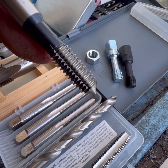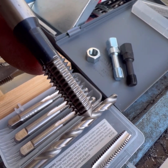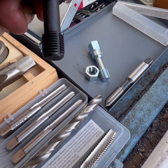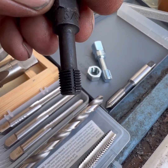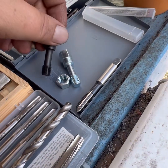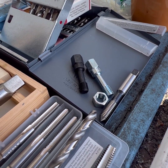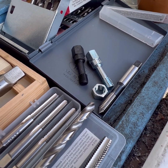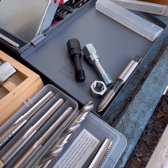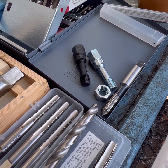For 351s and a lot of other vehicles, I think I have a 9/16 for big block Fords — that'll go in there and clean up your head bolt threads and make sure you get a proper torque reading. This is your fine thread version of the same re-threader thread chaser. These are not necessarily taps — the thing common between all these guys is they are not going to cut a brand new thread. They're just there to clean up your existing threads, and for a lot of guys that's really all you're going to need. Fairly inexpensive — you can get them on Amazon, a good auto parts store, or support your independent tool guy if you can.